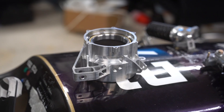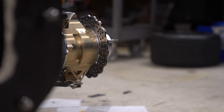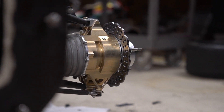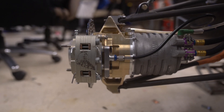The uprights have been traditionally machined out of 7075 T6 aluminum, which has a very good strength-to-weight ratio. But with the limitations of CNC machining, we're not able to access and remove a lot of the material, especially in the inner pockets. And so we wanted to go to I3D Manufacturing, who were kind enough to help 3D print these parts out of titanium 64, which also has very good material properties. With the process change, we're able to remove a lot more material, especially in areas that were previously impossible to access with CNC machining.